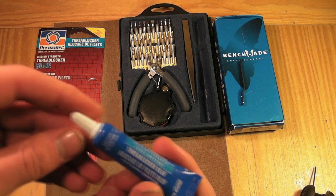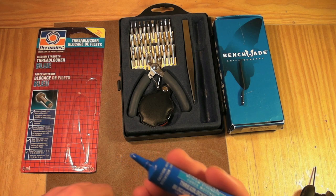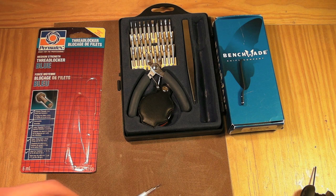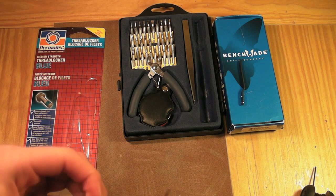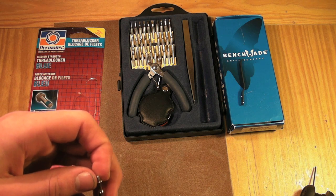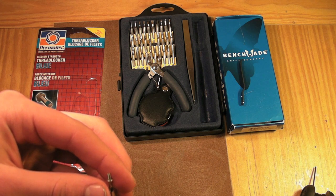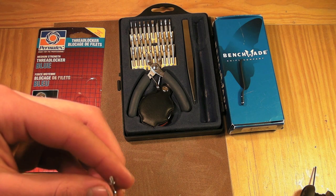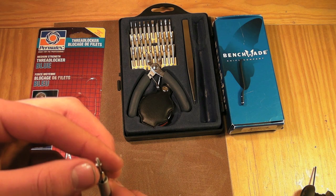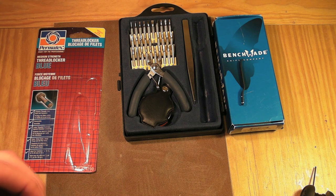But I'm not going to give you a huge tutorial on how to Loctite. But basically, what you're going to want to do is put Loctite on about half of the thread, not the whole thing. People often do the whole thing, but all you need is half. And actually, if you do the whole thing, you could run into over tightening. It'll spill over, and you could lock up your stuff permanently. Well, not necessarily permanently, but it could be a real pain to get it unlocked.